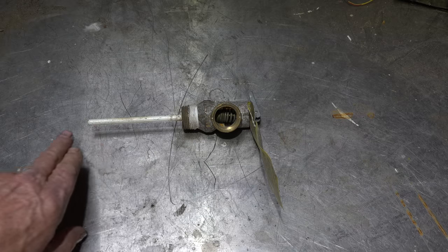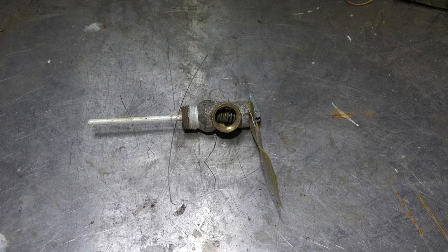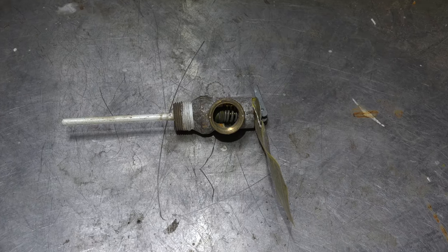What I want to look at first is the temperature aspect. I'm going to heat this rod up, because if this rod gets hot it's going to open that valve. I'll demonstrate how it works by heating it with a torch, so it will get well above 210 degrees just so we can see it.